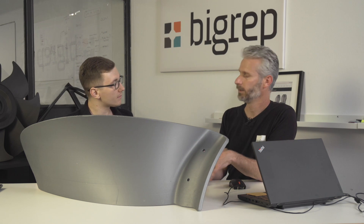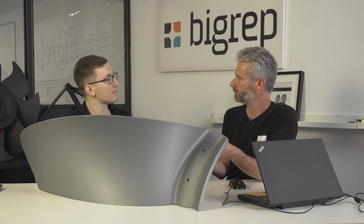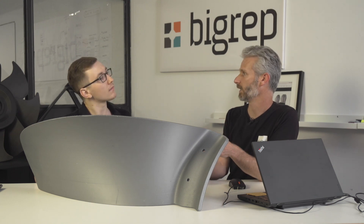That's right, but you have to remember it's a compromise between how many supports you use and how much contact surface you have with supports, because those surfaces tend to come out a bit less nice than the surfaces printed without any touch with supports.